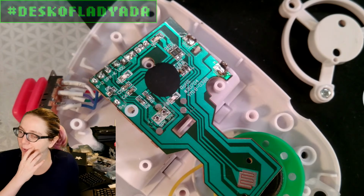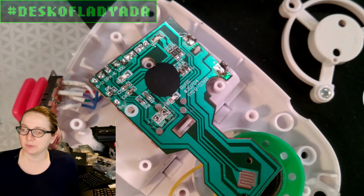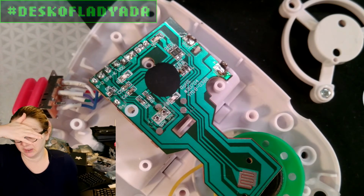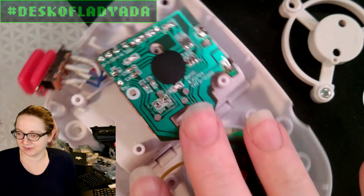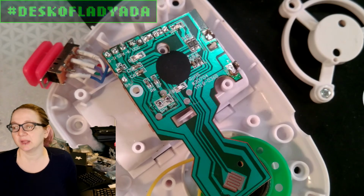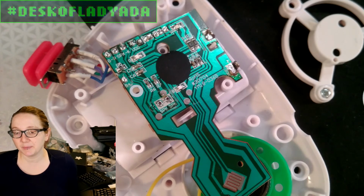Once you get the board, it's probably not too hard. So then the question is, from an engineering standpoint, what do we want to put in there? There's kind of two options. Either we could go with something like an RP2040, which is fairly low cost. It's never going to be as low cost as whatever they made here. This is mass manufactured. You can't beat somebody who's making literally millions of these a year for cost affordability. But the RP2040 has flash memory, and maybe the songs are stored on the flash, and there's an optional SD card slot if you want to toss an SD card in. We would play wave files, or we can actually play MP3s on the RP2040.